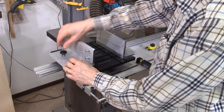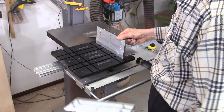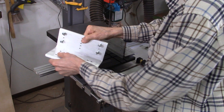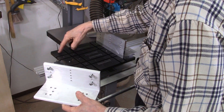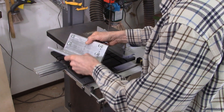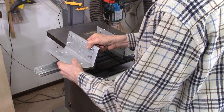This is a prototype of some new fences for the AccuSled to enable the cutting of logs. It consists of two 4x4 angle brackets with a bunch of holes drilled into it. I've got holes that match up with the threaded inserts in the AccuSled, and I've got some other tapped holes with screws in it that I can adjust in and out.